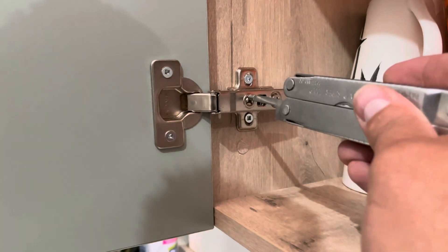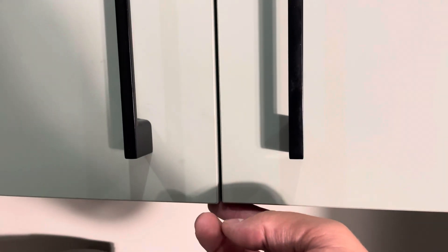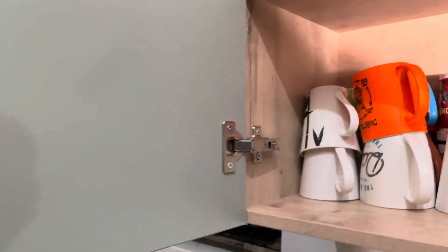That alignment will be if the door is not touching properly there, if there's a little bump — this one is nice. In our case we want to use this screw. We want to bring this door out a little bit to close up this gap. So you will adjust, close the door — excuse all the dirty marks, that is the downside of having super matte, it just marks up so easy. There, already better. We want to bring it about another millimeter or two. So we will just turn it some more and check it again. We can also check the gap up top so that the gap is nice and even.